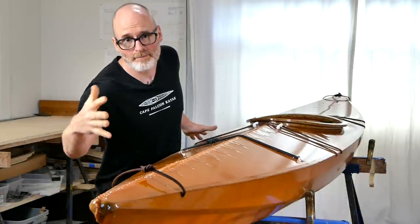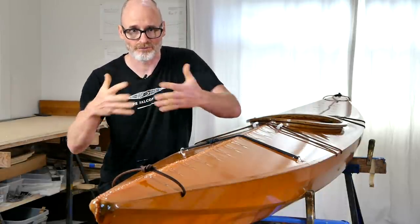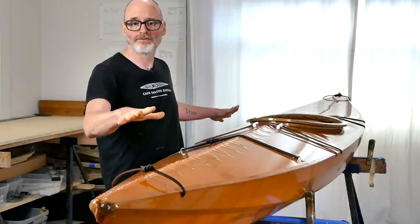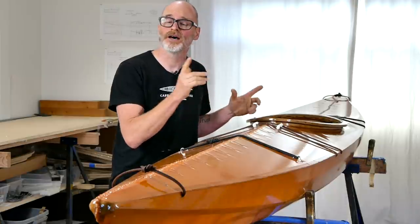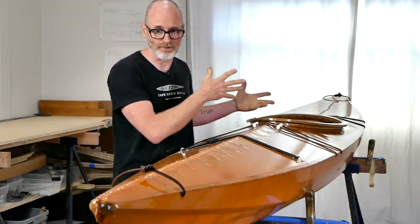Seeing how the bow shape interacted with the water, as far as how it was pushing water or not pushing water, was really important. Noticing that with the same overall rib shaping formula, but a slight increase in size, I ended up adding slightly too much volume to the stern at the same time, lets me know that I'm gonna have to modify that rib shaping formula in the stern of the boat.